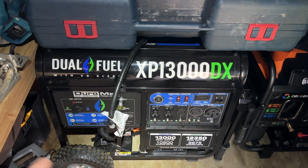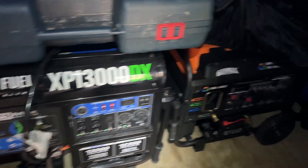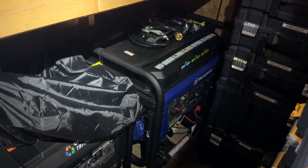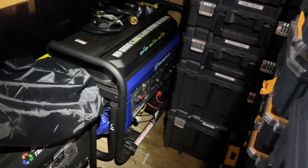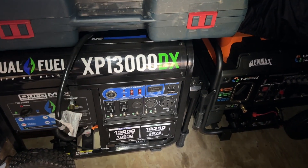This Westinghouse is in the same price arena — you're going to be about $1,400 to $1,500 either way. The Duromax is great for a job site, great for just a ton of power, nice reliable engine, but it just doesn't have that clean power like the Westinghouse does. If you guys are in the market for a big whole-house power generator, look at this particular model. Not all of the TFC series are like this — the WGen 11500 is the low total harmonic distortion rig you're going to want if you're powering sensitive electronics or whole home backup battery systems. Less than 5% versus 12% to 15%, sometimes 18%, depending on the generator. If this has helped you in any way, please thumbs up the video, subscribe, all that good stuff, and I'll make another educational video soon.